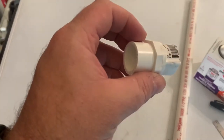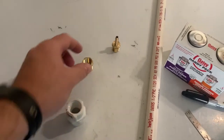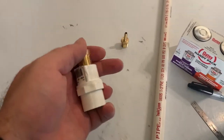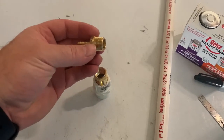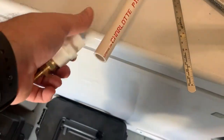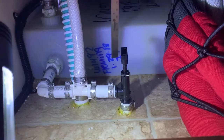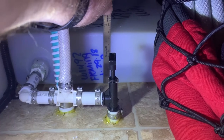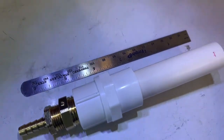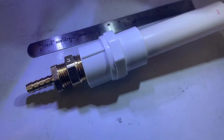I've got a threaded collar right here. Then I'm going to adapt to a hose barb with some step downs and then the actual threaded hose barb adapter. I'm also going to need some PVC pipe to make the pickup — they'll all attach together. To determine the length, I'm going to take a ruler and determine the depth of the tank and cut off the appropriate amount going from the collar to the bottom.